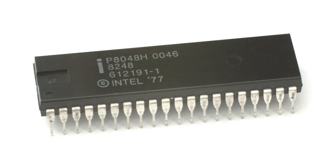The 8021 was also used in the keyboards for the TRS-80 Model 12, 12B, 16, 16B, and the Tandy 6000 and 6000 HD. The original IBM PC keyboard used an 8048 as its internal microcontroller. The PC/AT replaced the Intel 8255 peripheral interface chip at IO port addresses 0x60–63 with an 8042 accessible through port addresses 0x60 and 0x64.